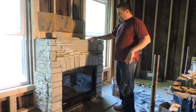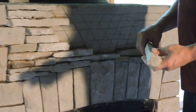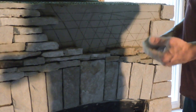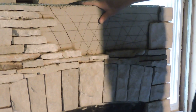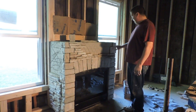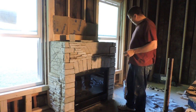With this situation, I found that the longer stones — I was laying in winter and trying to do the wet method — they just kept sagging and coming off. So I parged it in the winter, let it go, and now that it's summer and the temperature's up I'm able to apply this stuff very nicely. It knits to the parging very quickly and I don't have to stand here and play with the stones.